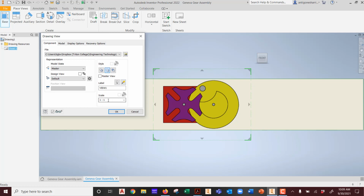Because the scale on this must be 1:1. Remember that scale matters a lot to us. You want to make sure that the product, when it comes to moving it to an actual piece of equipment, lasering, you cannot send it to that piece of equipment to scale, or when I say to scale, I mean to a specific 3/4 scale, 1/4 scale, unless that's what your company can do. You really want to send it to that piece of equipment 1:1 scale. And in industry, you might hear you got to send it to scale. What they mean when they say that, 99% of the time they mean it's got to be sent there 1:1. That's what they're really saying.